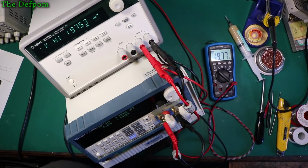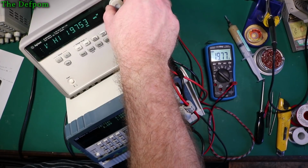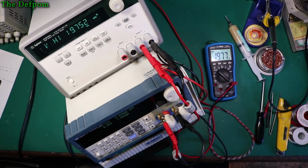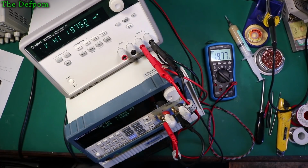But this might time out by then. It's drifting down to 752 certainly. If you don't get this quite right, then those output readings and what you actually read on the display will not match up, which is what I was getting before in channel 2. I didn't wait very long when I did it before. I just whacked them in, moved on. So this time I'm giving it a chance to stabilise first, which might make all the difference.